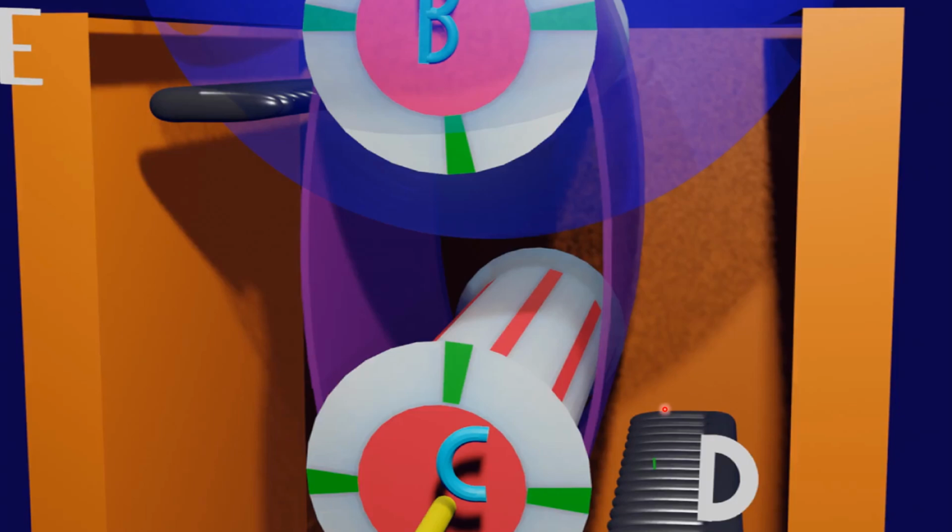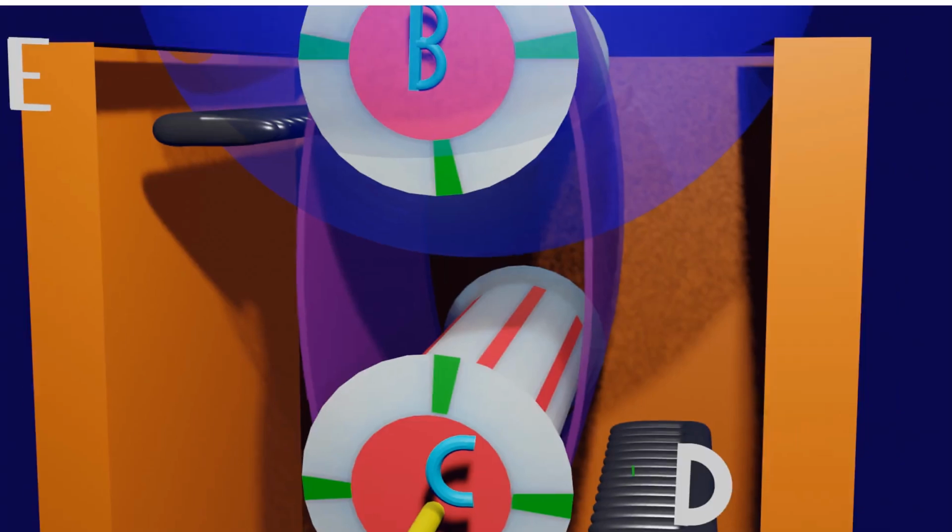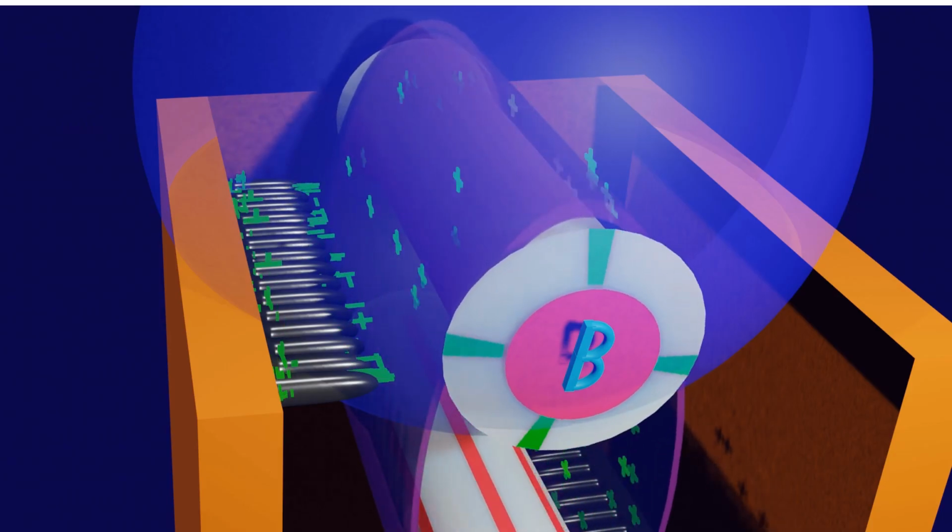Due to high electric field near the comb D, air between the belt and comb D gets ionized by the action of points, so that more number of positive and negative charges are produced. The negative charges are attracted by the comb D and the rest of the positive charges are pushed towards the belt. The positive charges stick on the belt and move up.